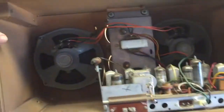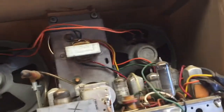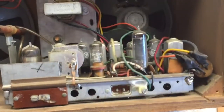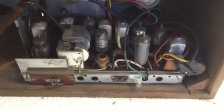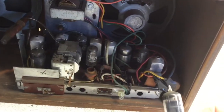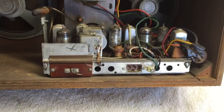So great little box, well constructed, pretty solid. Two little tiny speakers — they look to be in good shape. This is a hot chassis, what they call a hot chassis system. This is a 50HK6 tube, so there's no transformer on this.